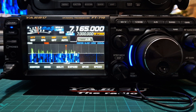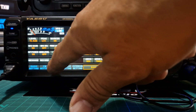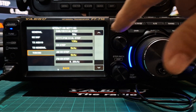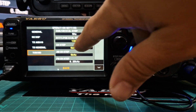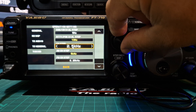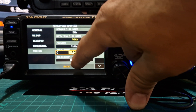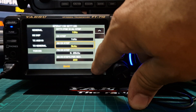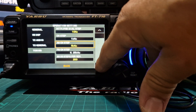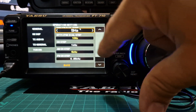Welcome to my channel. For tuning steps, go to Function, then Operation, then select Tuning. If you're on SSB there is also RTTY — you've got channel steps as well, you can lower that to 1kHz. For AM and FM keep going down. Main steps per rev — that's your tuning steps, with SSB at the top.